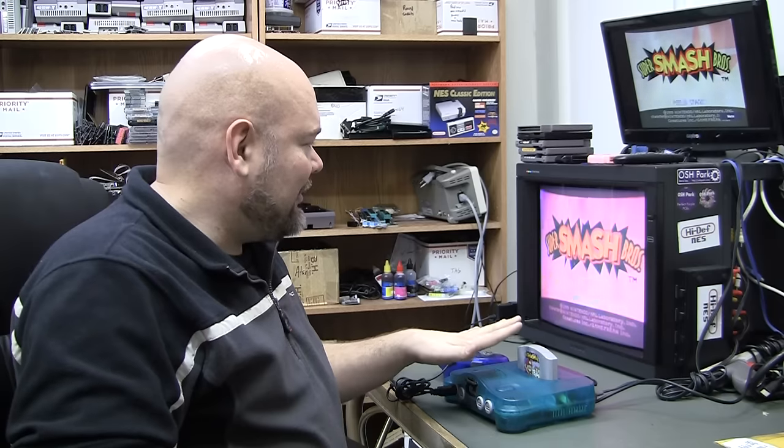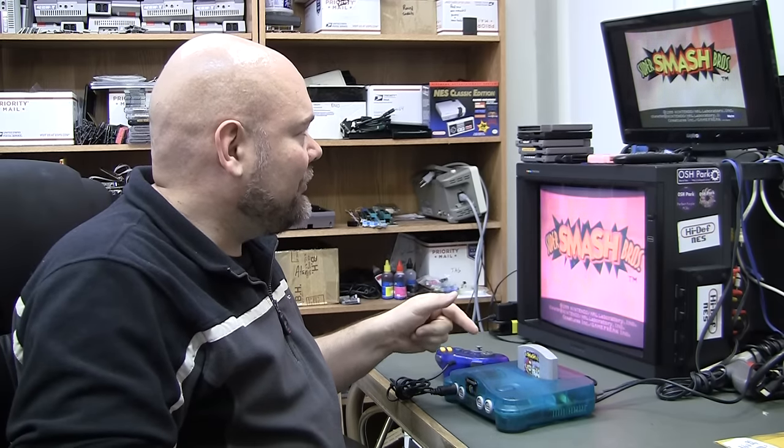So I'm going to let this sit and cycle through the attract mode for maybe even overnight, just to be sure that everything's good to go with the capacitors and whatnot. But I think we're safe. I might try to get the final okay from Marshall, see if he has any qualms about me using the big SMD ceramic caps over the electrolytics, but I think it's safe to say it's okay. I've been doing it on the Duos for like 2 years now. I haven't done a lot of them, but I did some 2 years ago and they're still out there working, so if it was not a thing you could do, I'd probably have heard about it by now.